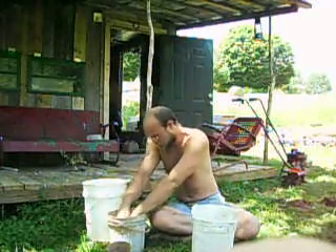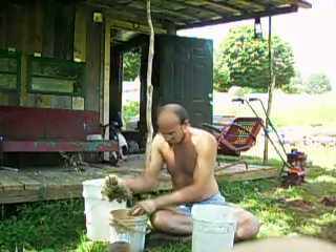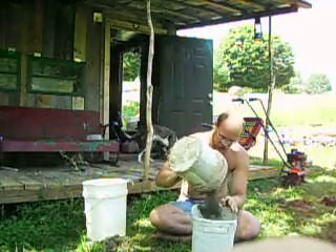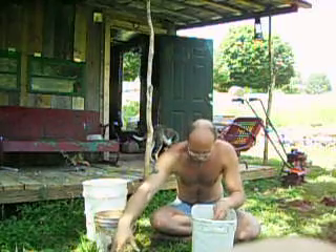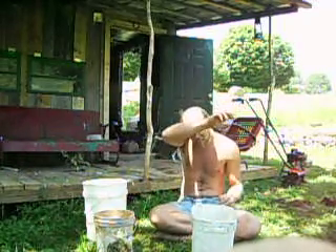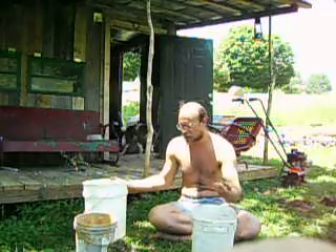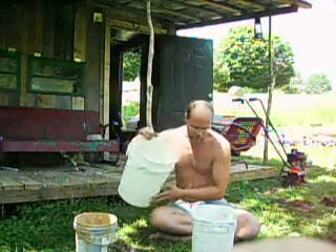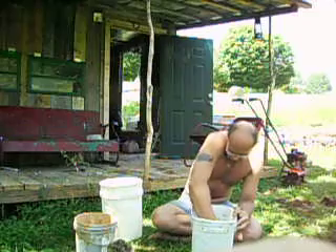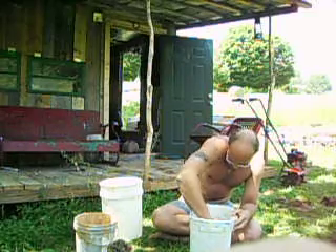Let's break this up into little fine, small particles. The manure does kind of a chemical process to strengthen it, and the straw works as a binder. So that's kind of what you're dealing with. Then you just knead it all together and add a little water. Try to get these big chunks broke up.